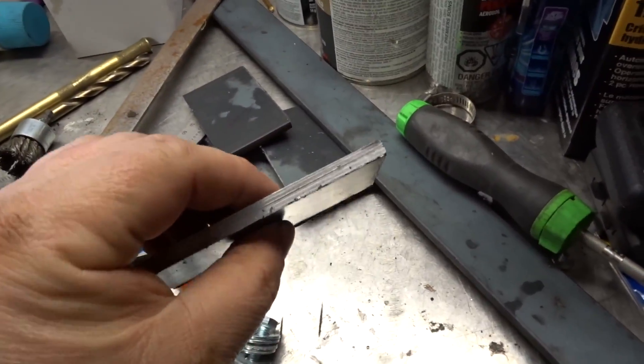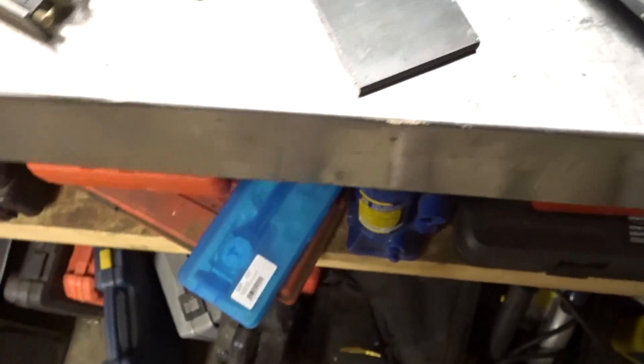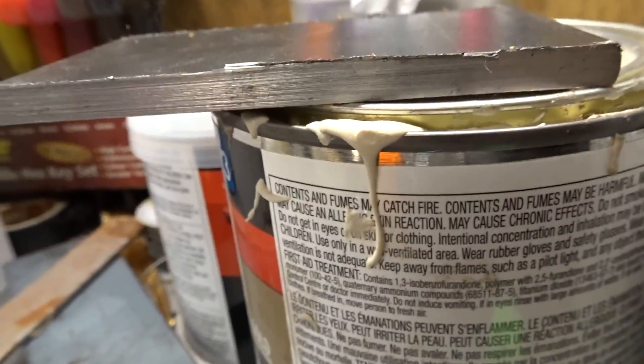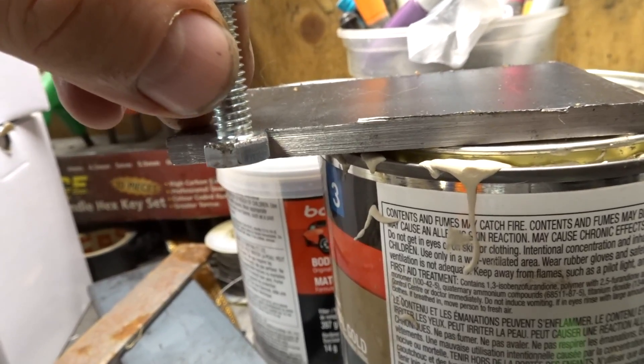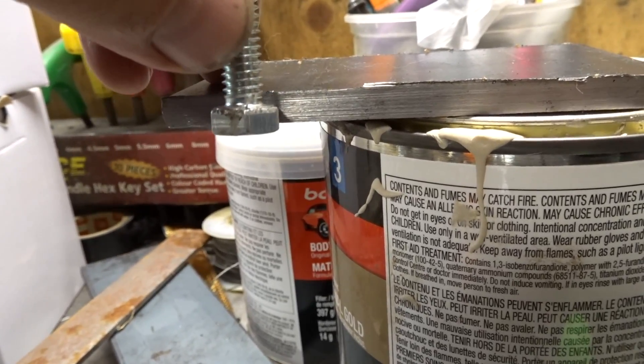Last night while I was sleeping and today the ideas were turning in my head, and this is what I came up with. These pieces of metal I picked up a while ago — we need to cut some metal about the same width and stand it up right here. We're going to weld that on, then machine it out so the bolts sit in there like a T-bolt. That way if those nuts ever break, you'll be able to slide it out and put in a new bolt and off to the races.